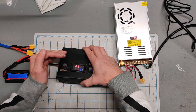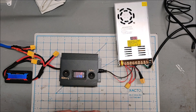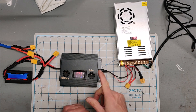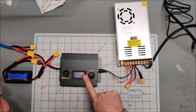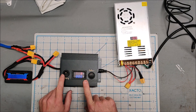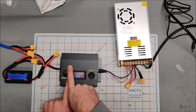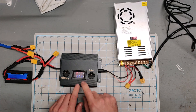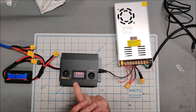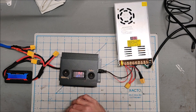So yeah, here we have a DIY solar charge controller that is doing what it's supposed to. Another nice thing is I can kill the solar input and you actually see the battery voltage. If the battery is on but the solar is off, you see the battery voltage. If the battery is off and the solar is on, you see what the boost circuit is currently trying to output. And then when you turn on both, you'll see the amps being charged and the midpoint between the voltages until that rises and you get equilibrium in the battery — then the amps will taper off. Yeah, that's my little build and I'm pretty happy with it.